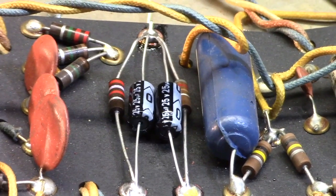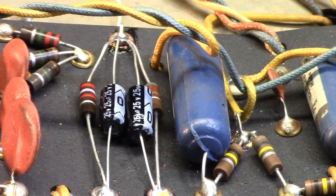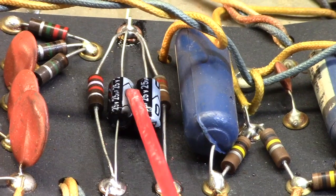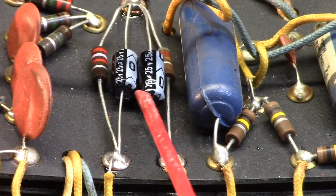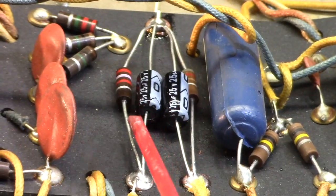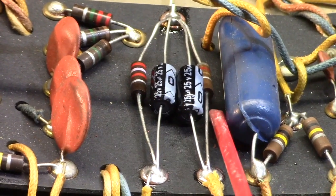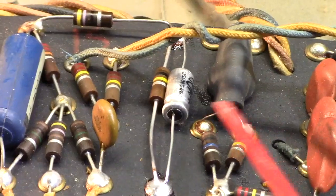We come down here, and these are the normal and vibrato channels second preamp cathode resistor and capacitor. So this is for the second preamp, in other words, gain makeup, basically. These resistors, this 820 and this 2.7K here, these were good. They're original, and I left them in place, and we just changed out the caps. And then we come down here,